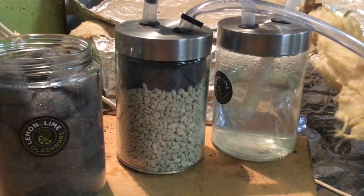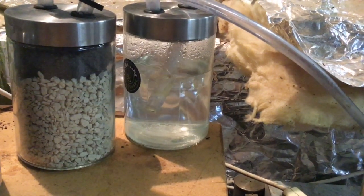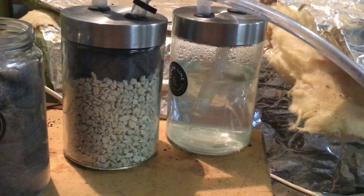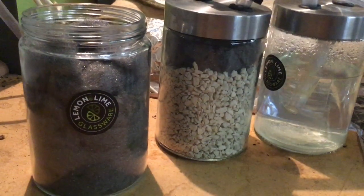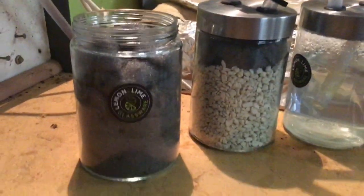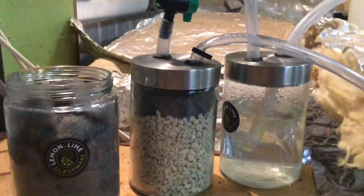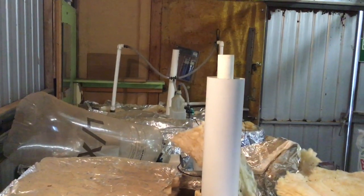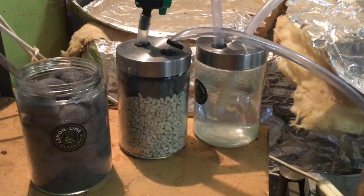Here are all the lines set up again. I was going to do the three jars but I opted for just two, because people have asked me how long the steel wool lasts. As we saw from the last video, how it turns black and brown — I thought I'd test it first with a little amount in this one. That jar has a bleachy solution in it, so it should still be alkaline. The steel wool is for the hydrogen sulfide, and the pellets are for the moisture — not for hydrogen sulfide or anything like that. When I get an update on that I'll let you guys know, and then we'll start doing the separate ones. The middle one with the clay pellets will just be clay pellets, and the big one will be just steel wool. Having these in see-through glass jars is a good idea so I can keep an eye on it. Everything is hooked up — gas lines hooked up there — and I've still got that old airlock in the centre of the screen, which will have to be replaced at some stage.